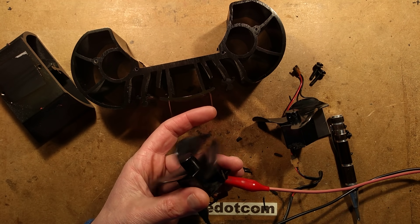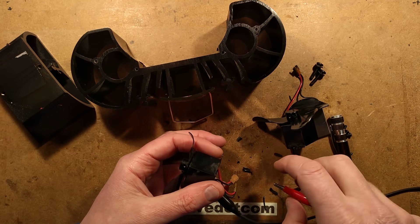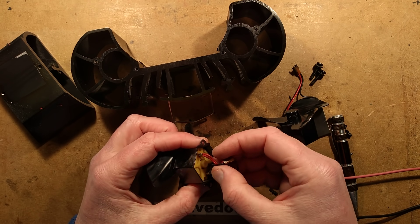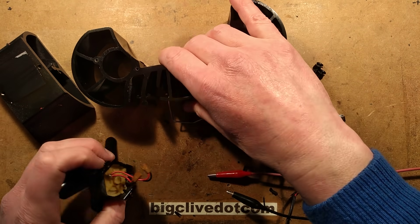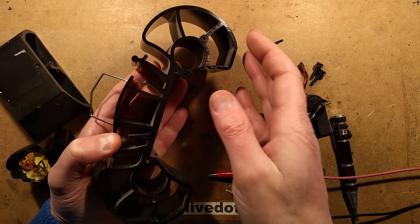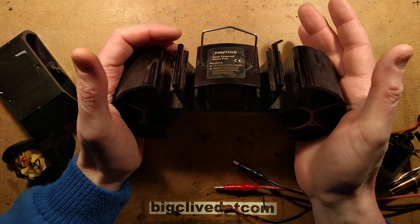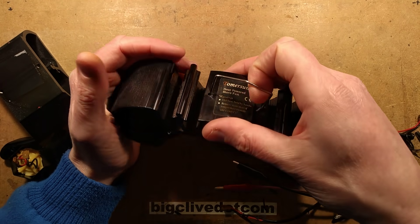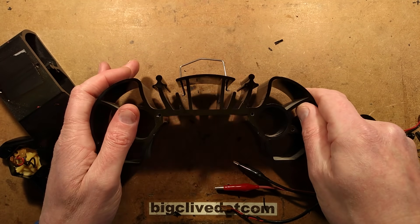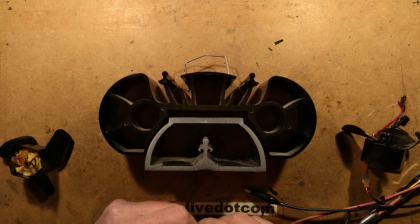This thing will basically just generate enough to keep these trundling over but it's noisy. I wonder if these motors can be changed. I'm going to have to measure these and see, but the wiring is absolutely solid suggesting everything has been baked. That issue of if they don't start up soon enough — everything just bakes. The answer, if you've got one of these and it doesn't seem to start quickly as the fire heats up, is to actually lift it off, let the stove come up to heat, and then place it on the stove afterwards. At that point there will be a sudden temperature differential between the bottom half and the top half and it will probably kick up faster. But this one has been baked.